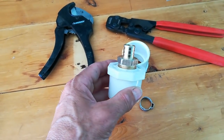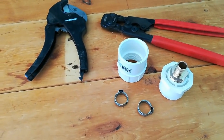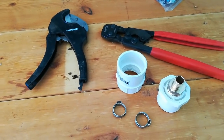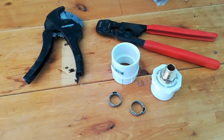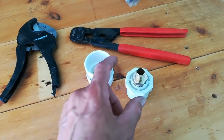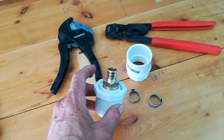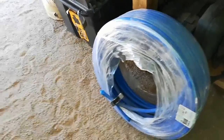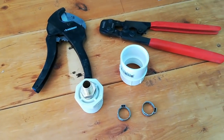You can get these fittings in plastic, but for our water line we only needed about four fittings, and I'd much prefer to have brass buried in the ground rather than plastic. Plastic would be okay for interior water lines in a house, but for this application I'd spend a little more. This adapter here lets us go from the inch-and-a-half water line down to three-quarter inch PEX. The brass fitting just slips into the end, the pinch ring goes over it, and you squeeze it shut with the tool.